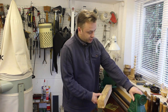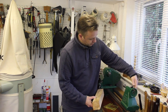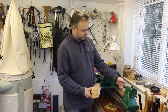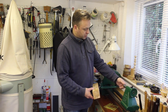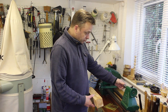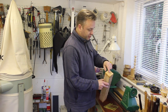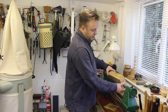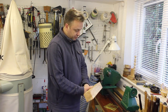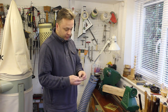So this is the tailstock end. It moves along and it winds backwards and forwards. In the tailstock you have a live centre. And this live centre basically spins around. So when we make a hole in this end of the wood and put it in there, this spins with it. At this end we can drive it two different ways, well at least I've got two different options,